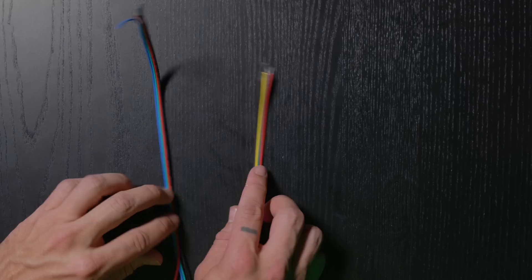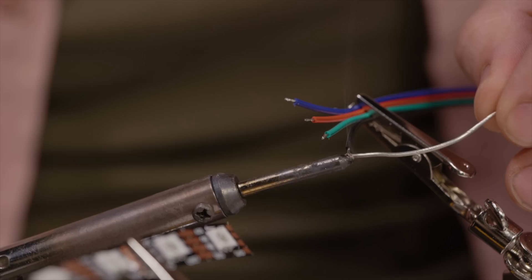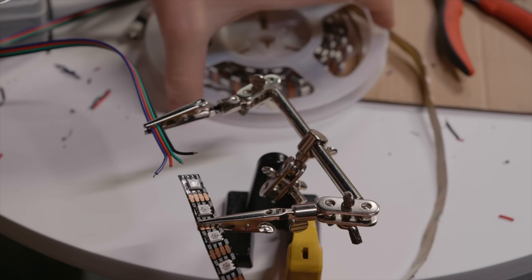Now it's time to solder the cables into the LED strip. I recommend 18-gauge or 20-gauge wire instead of the 22-gauge I used. If you go with only three pins, it allows for thicker gauge cable so more power can travel through to the next LED strip — thinner wires lose more power down the line and require more power injection. To connect cabling to the LED strip, watch a YouTube tutorial on soldering and make sure you have a good solder tool. Also pick up an alligator clip holder — it will save you an enormous amount of time and stress.